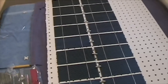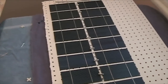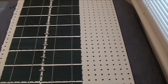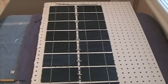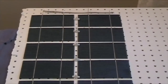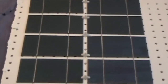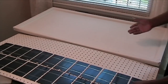After getting a few done — two columns — I went ahead and put them on my pegboard so I could see exactly where to position them. Before putting the pegboard on the plywood, I wanted to see where my screws would have to be. I used tile spacers to make sure the solar cells were evenly apart and figure out what the third column is going to look like. This gives me an idea of where I'll need screws and where I need to drill my positive and negative connection wires. I also have my bus wire up here. I'll have screws on the outside of the pegboard and maybe two or three in the middle along this line, and two or three between the second and third column.